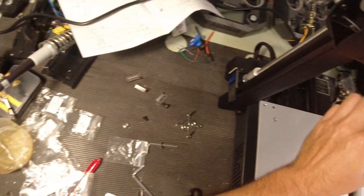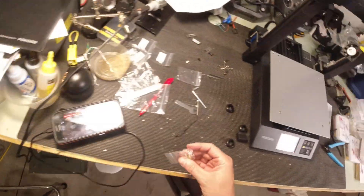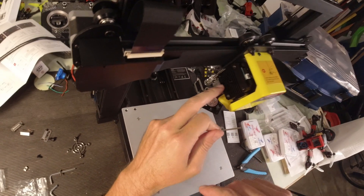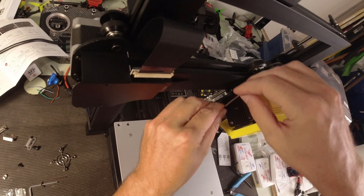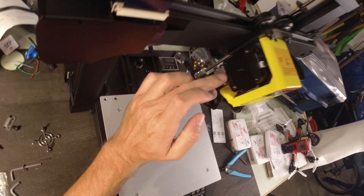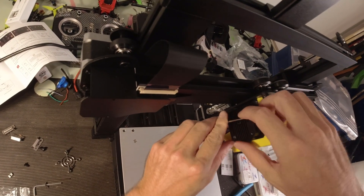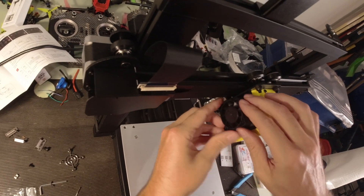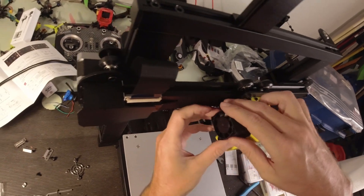So those were some additional hot ends — some pieces here, some additional hot ends. There's a set screw in this hole here, and you want to make sure that is good and tight. Some folks were having issues where this hot end assembly was pushing out down because the direct drive extruder wasn't tight enough and it was pushing it down. Mine is really tight, so that might have been something early on that's now fixed up. Don't pay attention to that.